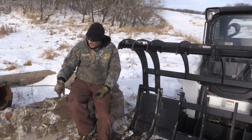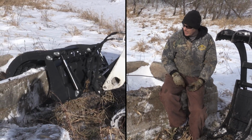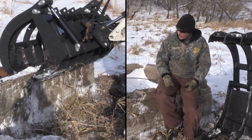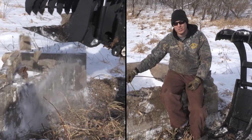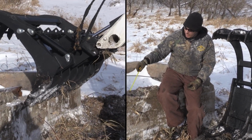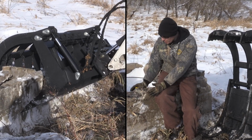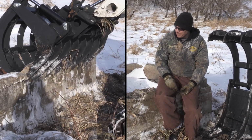Then I came in and I hit this water tank here a few times, not very hard, because I didn't know how solid it was. There were a few cracks along the top here. At the top here, it's 7 inches thick, and it has rebar in it, so it's quite stout. It's tapered as it goes down, so it gets thicker and thicker down the wall. I thought I'd be able to crack it more, but could not budge it.